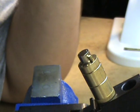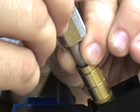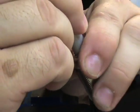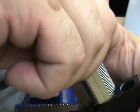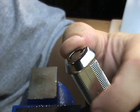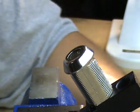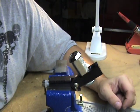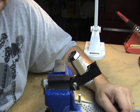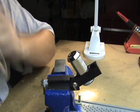When it's loaded up all the way around, take the follower and put it back on. Take the plug housing — the threaded part — put it back over the top and push it back down all the way until it seats. Take your follower out, then put your plug back in and you're set. So that's how you disassemble, repin if you need to, and reassemble an ACE type tubular cam lock. Thanks for watching.